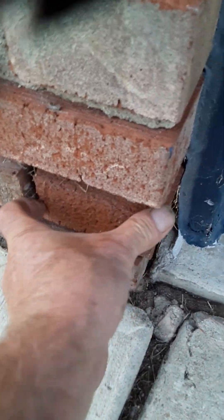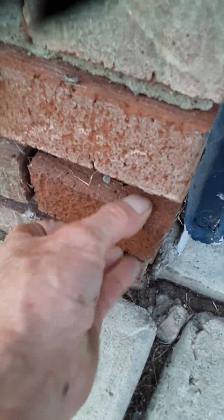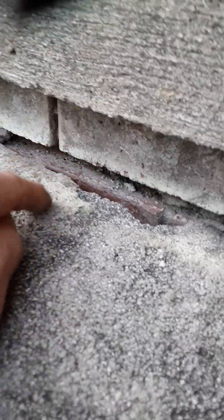Also you've got some tuck pointing over here — we can give you an estimate on that. The bricks are loose; you can just take it out and move it around. It'll straighten it out a little bit. On the front porch you also have some mortar missing right here — move the step back, fix this, grind it out, rinse clean, refill with fresh mortar. All the other masonry seems to be good on the house, just a couple of little spots — not that bad.